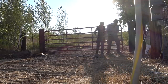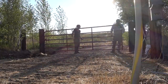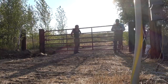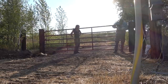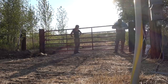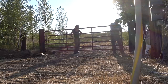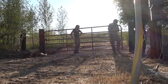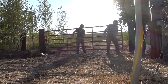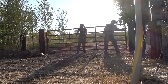We actually made a permanent block as well, as you'll see a little bit later, because over time any gate that is just hanging from its hinges — no matter how solid the post is — will eventually cause problems. You can probably see this as you drive around and look at some farm gates in fields. If the other end is not resting on something and is prying on the main post 24 hours a day, it will eventually bend the gate, pull the post sideways, or both. So when we got the finished product, there's a little permanent block bolted to that free-swinging end so when you swing the gate closed, you lift it a tiny hair so it rests on that block and sits level instead of prying on the hinges the whole time.